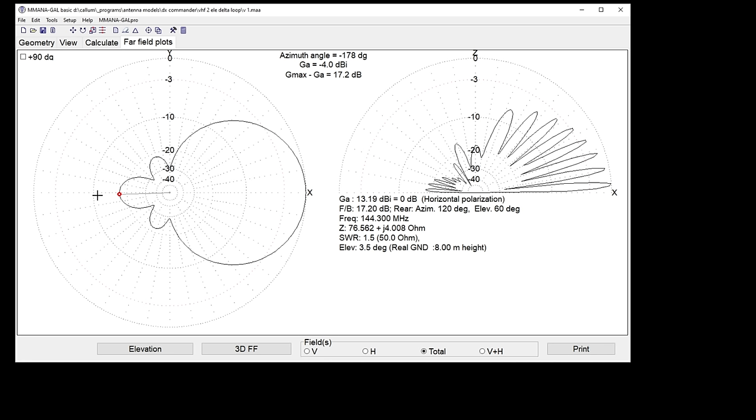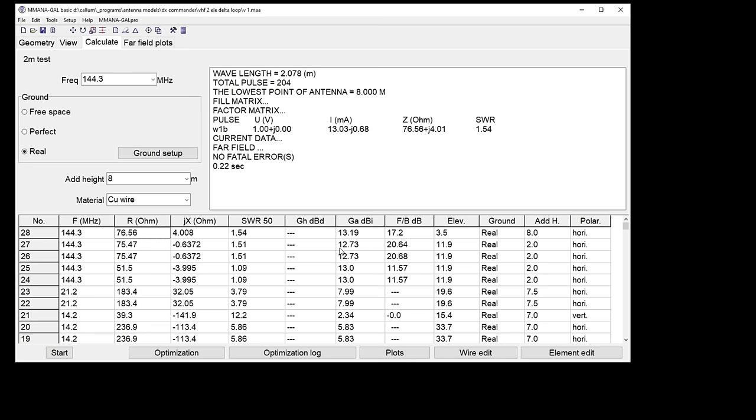If I go to 8 meters high — which is doable as a little portable Tuesday-night setup, which we do in the UK — it's a lovely looking antenna. Max gain is 13.2 dBi at four degrees off the horizon, and you'd hardly hear the guy behind you. Tremendous. Nice little two-element Delta Loop. Now, how would you match 75 ohms to 50 ohms? Put it in the comments — it's a little coax stub isn't it, but I can't remember off the top of my head. So you have front-to-back or perfect match — you can't have both. Have a lovely day, hopefully this has inspired you, see you on the next one.